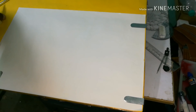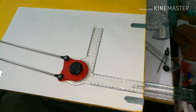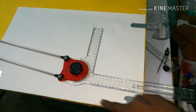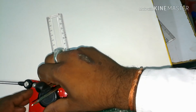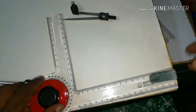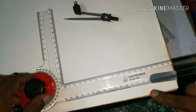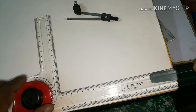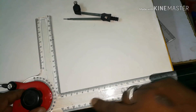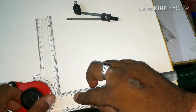Now the drawing sheet is ready. Adjust your drafter for zero angle setting over the edge of the drawing sheet. Release the nut by rotating anti-clockwise so the scale can be moved. Adjust the scale so the drawing sheet edge coincides with the edge of the scale. Keep adjusting the scale so that the paper edge, drawing sheet edge, and scale edge all coincide.